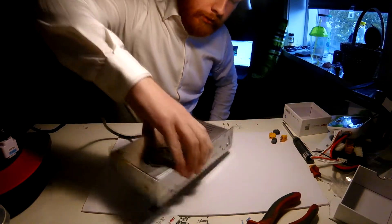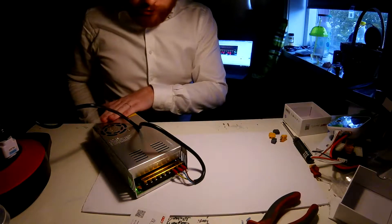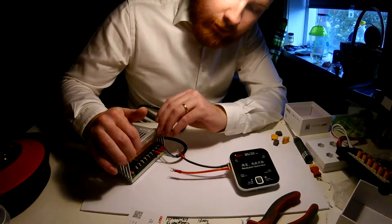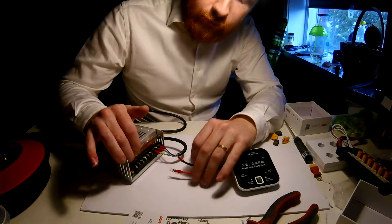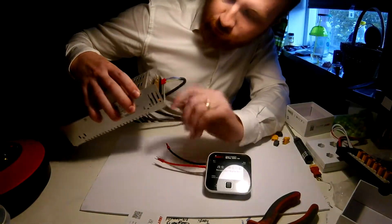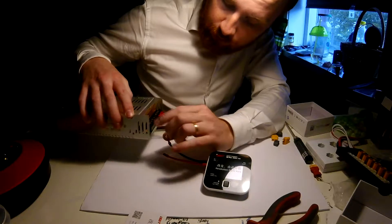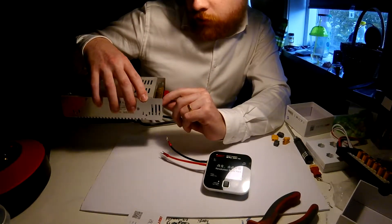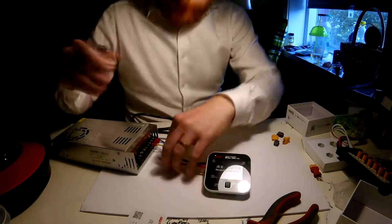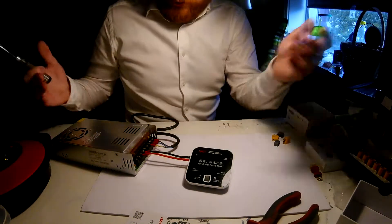Now if I plug this in - the fan is on and we got a green light here on the LED. So that should mean we're getting power. Now this ISDT charger just has an XT60 plug which has red and black wires which are gonna go into the V plus and V minus. I believe it doesn't really matter which port you plug it into - they all just output a positive 12 volts. So we're gonna put this into ports 3 and 4, 3 being the red wire and 4 being the black wire. There we go, we're all plugged in.